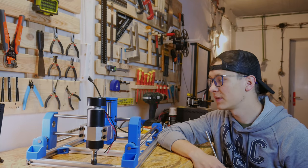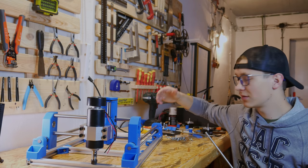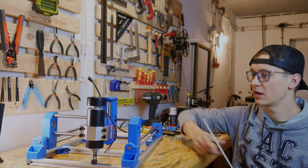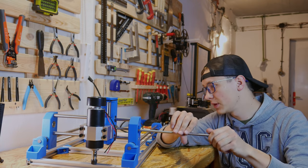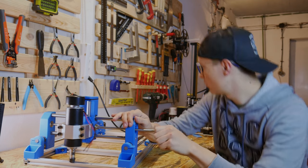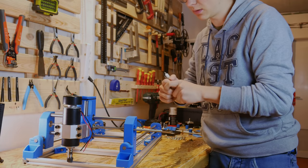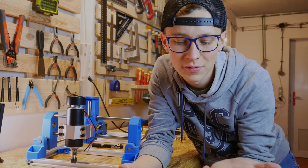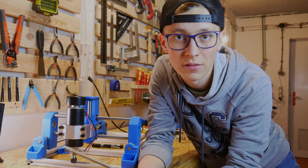About half of the CNC is ready. I broke the couplers and had to print them again — the only filament I have right now is black, so those are black. Now I need to measure how long the screw for the x-axis should be, because I bought it slightly too long, so I will put it in place and roughly measure that. You can cut this thing with basically anything — even a hand saw — but because it's pretty hard steel, the best way to cut it is to use an angle grinder.